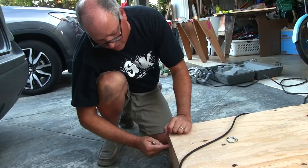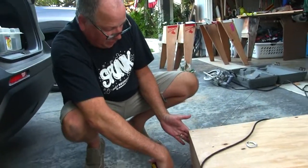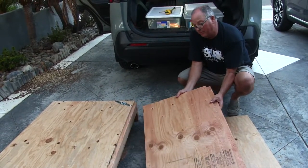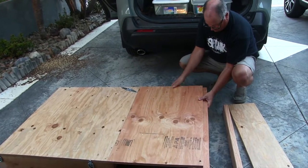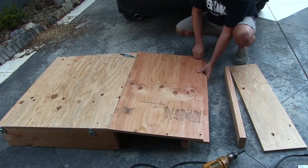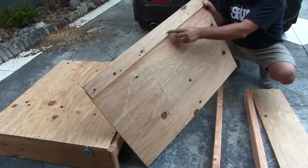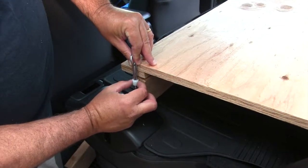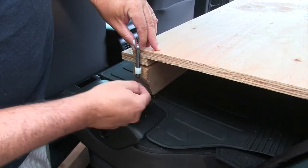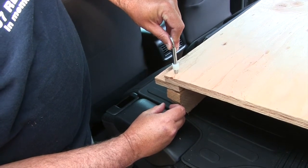Because the buckle is on the wheel well — five and a half inches from the end of the 2x8. Panel number two will be in this position, resting on a lip that we created with that 2x4. The pin will come in and engage this hole here, and that's what's going to keep this in place. It has the lip screwed on like this. This nylon bushing will be glued into a hole in the side of this cross beam. Here you can see the chamfer lands on the rubber weather mat, so we're going to drill a hole right about here for that to go down.